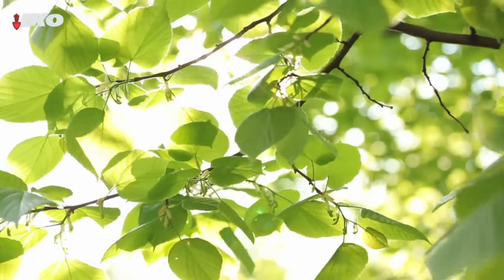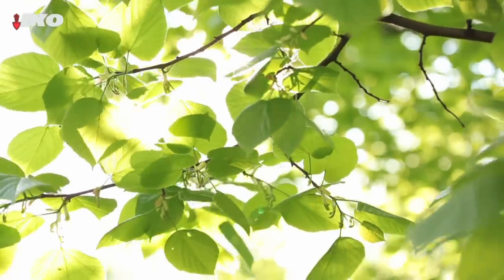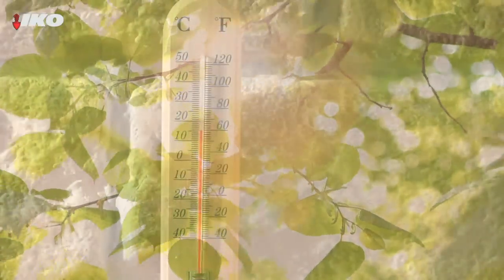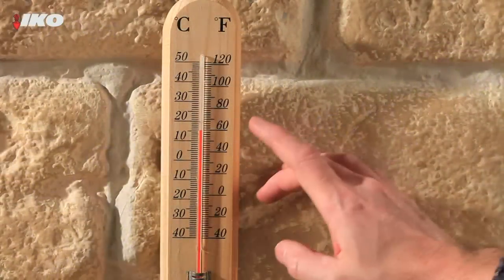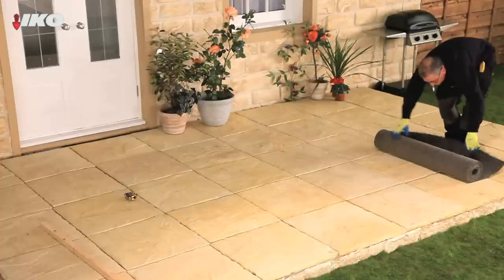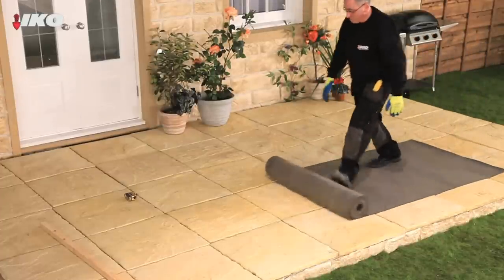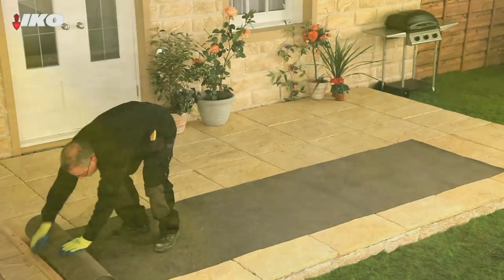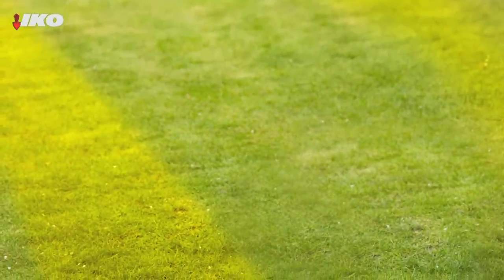Now let's look at fitting felt roofing shingles. First, pick a dry, still day. For best results, the ambient air temperature should be above 5 degrees Celsius. Then unroll the underlay onto a clean, flat surface 30 minutes before you need it, so it has a chance to flatten out. It's best not to use your lawn for this as some temporary yellowing of the grass may occur.